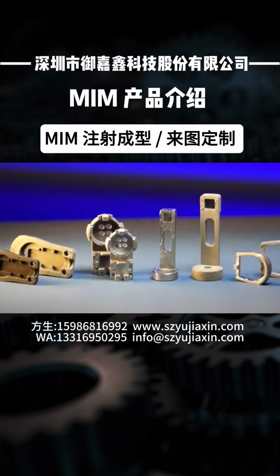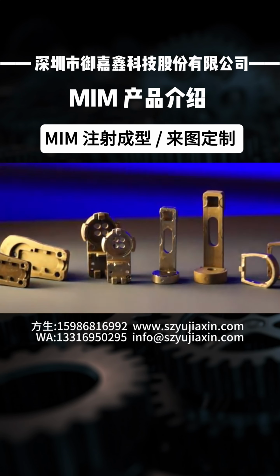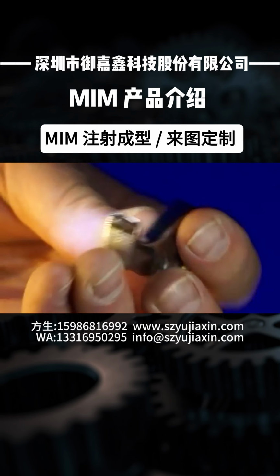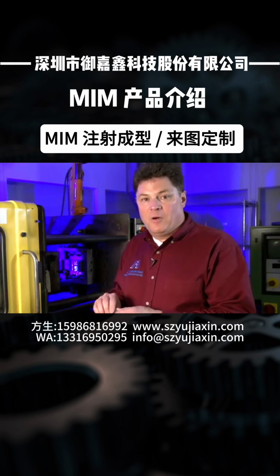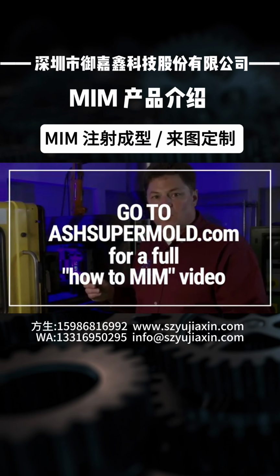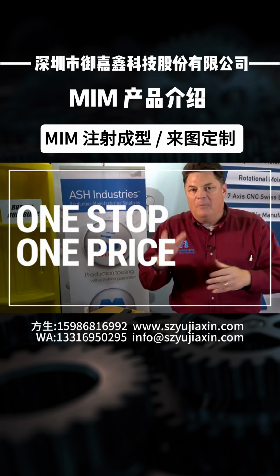The part is molded in the net shape. That means that all the delicate features, the holes, the located ribs, all the things that are critical to the customer are already in place. We then sinter that part in a hydrogen backfilled oven at 2400 degrees, and what's left is 100% metal, net shape. The SuperMold is one stop, one price.